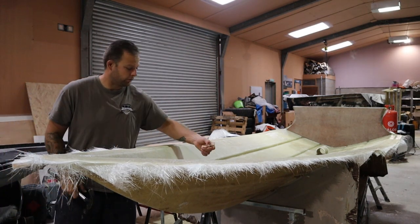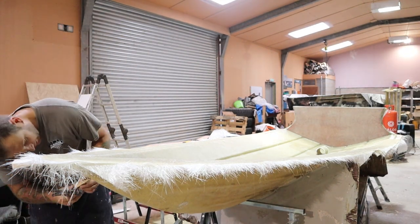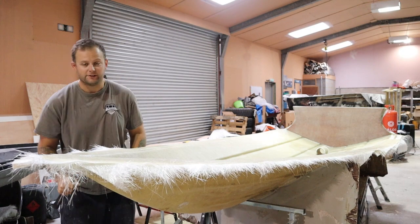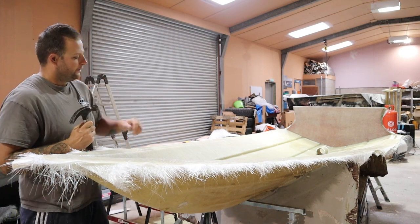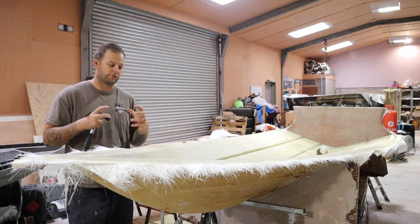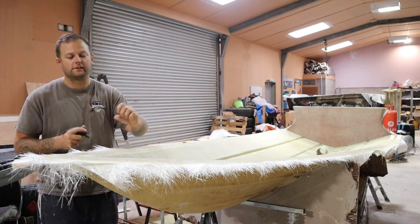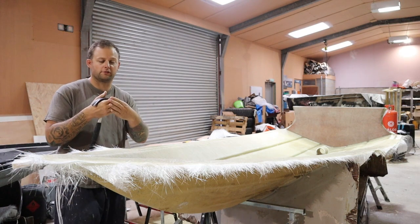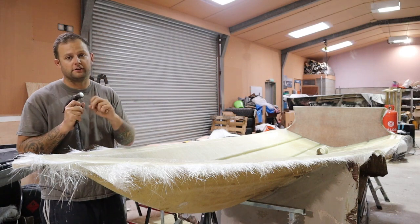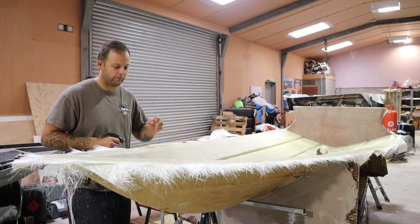So if you are doing this for the first time, I probably would advise safety goggles. I wouldn't advise using a screwdriver, because you only learn from doing things wrong, not from doing it right. So I've had an accident with this screwdriver, but there was a lot of tension on the mould. I put the screwdriver in there because it was so tight, I just needed something hard enough, because I couldn't drive a hard wooden wedge into the mould because the tension is so great between the two halves of the mould that you just disintegrate it and everything like this. So I use something hard to get the initial bit open, and then that way you can start inserting plastic or wood wedges, whatever you want to do from that point, okay?